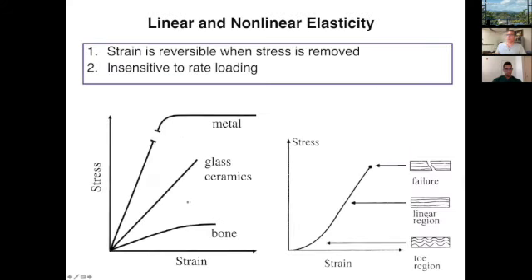Looking at the stress-strain curve, bone has a fairly large amount of elasticity, and that elastic behavior is followed by some plastic deformation. Ultimately bone fails in its plastic regime — if you push it too far, it will fail at the point of plastic deformation. Brittle materials such as glasses and ceramics actually fail prior to any plastic deformation. They're not capable of sustaining any plastic deformation, and that's what makes them brittle — once you induce damage, it's catastrophic.